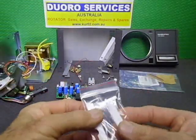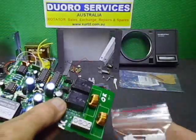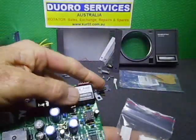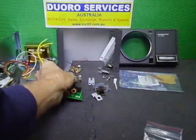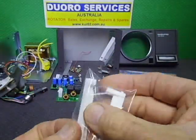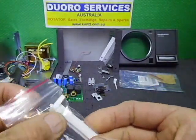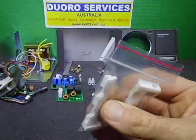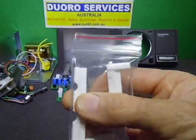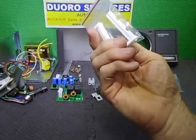I had to do a bit of grinding to get clearance around the coils and other components. These new supports are 3D printed — specifically laser-sintered, meaning a powder is formed by a laser into the structure rather than melted plastic, giving a stronger result with a higher temperature rating.